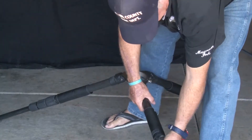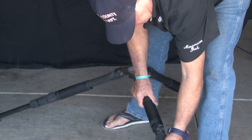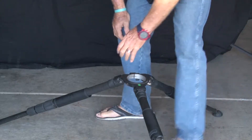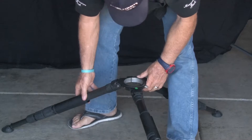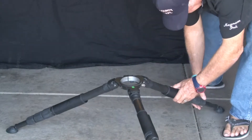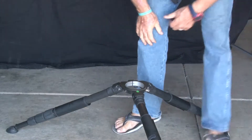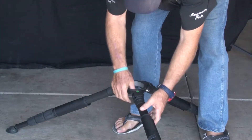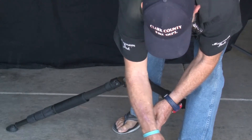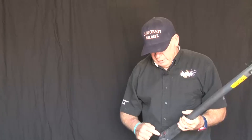You might need a little more of the secondary leg that comes out. Put that out a little bit. To get your level, you have to get this bubble level to start. Right now we need to come back a little — need a little more. Maybe this leg back a little. We'll bring this second one out a little bit more. And now we're level — we're right on the money. Red nuts right here, and you have two red bolts — wing nuts.